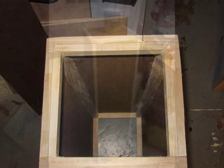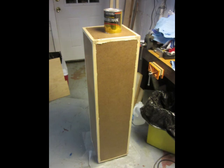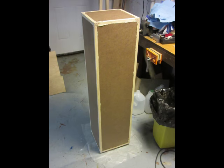What I do is I start out with a small piece of plywood, just a bit smaller than the end inlay, set that on the floor, put the inlay on one side with its glue, and upend the whole case so that the new glued end is on the bottom, with the weight of the case pressing the inlay into the recess. Then I put the remaining inlay on the top and use something like a paint can or a brick or whatever to weigh it down, and this works just about as good as the clamps. Once all the panels are in, I just go around the edge with a chisel and remove any excess Gorilla Glue that foamed out on the external side of the case.